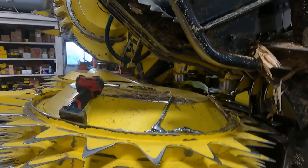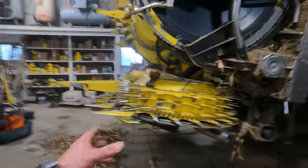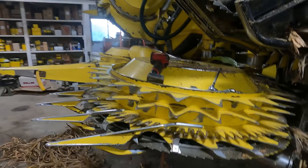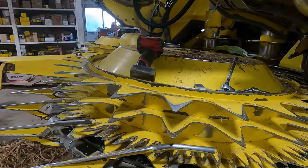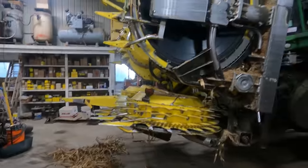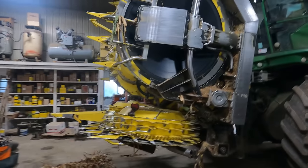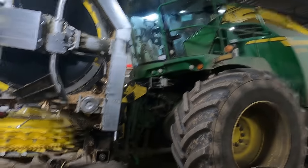There's this little plate that goes on the bottom of the knife drum here. We need to install a couple of those. I had leaves building up on these units here, and then once the leaves build up, it builds out to the end of the knife, and then the drum doesn't cut and you end up knocking corn over. So we're gonna get them on there, then we'll sharpen the knives, and then we'll be able to roll out